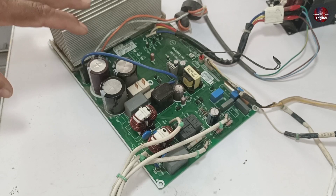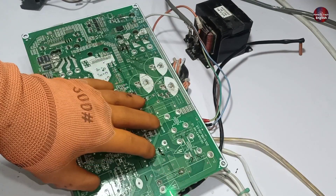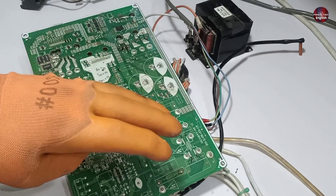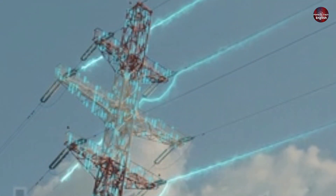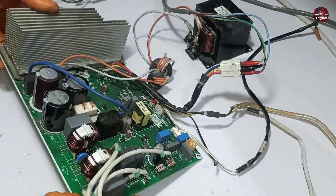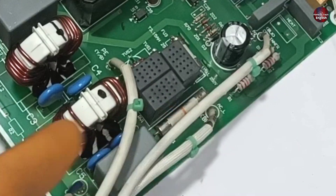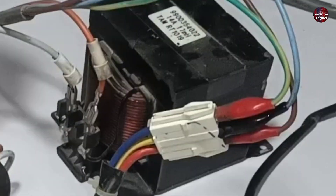Now I will tell you what PFC is. PFC stands for power factor correction. When electricity is passed through the control board, it could have spikes — or in simple words, over voltage — in the form of voltage or current. For filtering these spikes, a circuit is installed in the PCB: after the fuse, a capacitor, a line filter, again a capacitor, then the reactor.